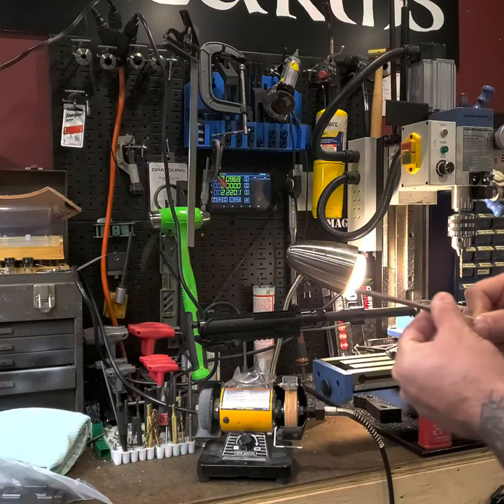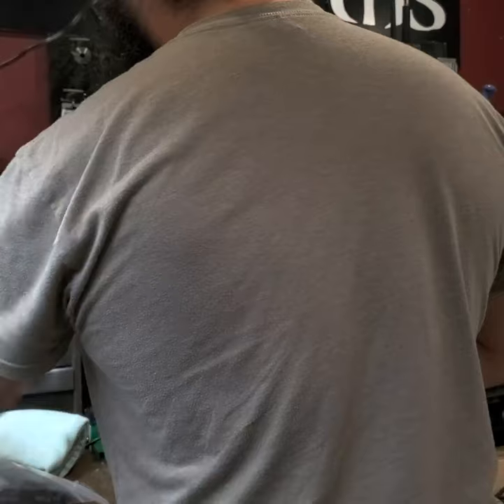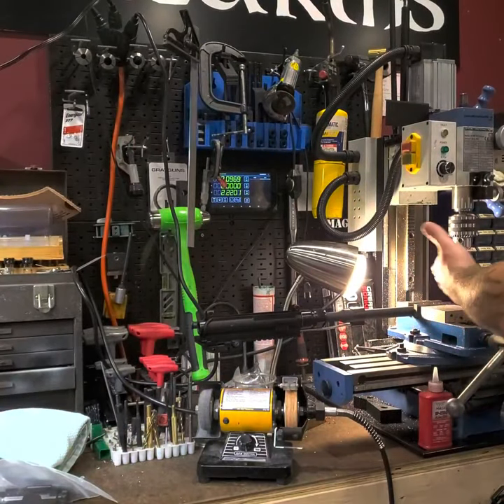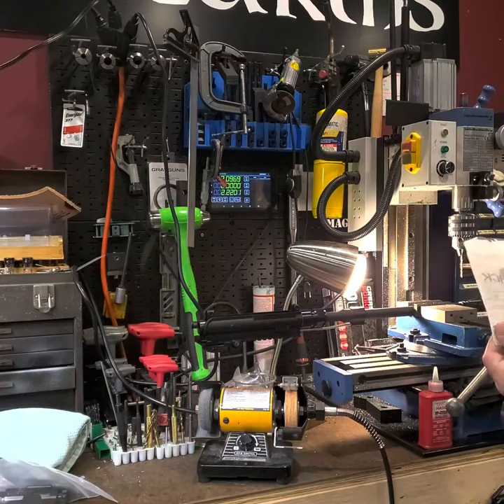If you can't really see my reaction rod, there are zero marks on it — and that's for good reason. I don't drill through my good equipment. This rod is probably about 80 bucks. Now we're good to go: the hole is set, our equipment told us exactly where we need it, and we did not drill through the barrel. I have pre-made pins from McMaster — 3 millimeter stainless steel pins that come in a pack, you don't have to cut them, and they drop right in. With this specific configuration the barrel diameter is a bit bigger so those were a little too small, so I have a longer pin I'll just cut down.